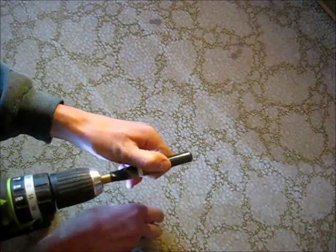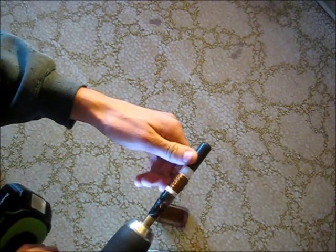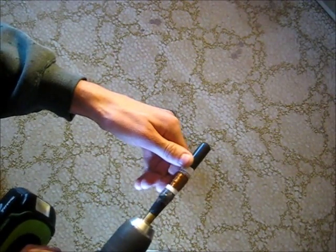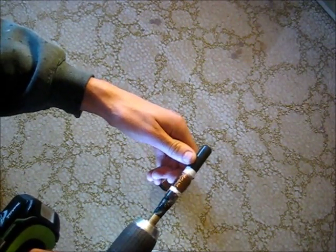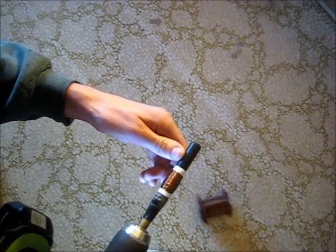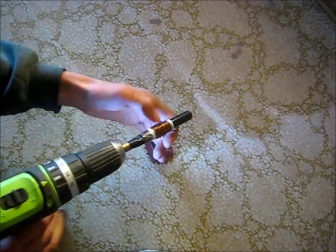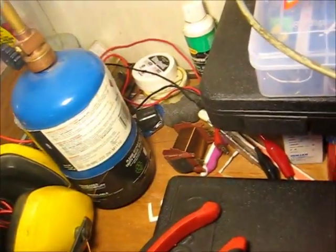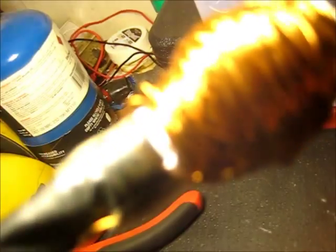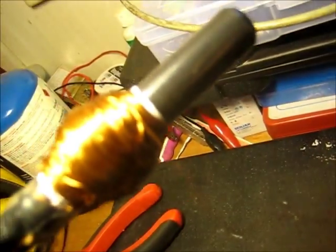Wind mostly in the middle. Now if I could do it properly I could get use out of the whole 240 volt winding — that'd be handy, though it may not fit. Still got a fair bit left on that magnet wire and that core. Messed up a tiny bit — didn't press it hard enough against each other and it just slightly unravelled. I hope it doesn't cause too much problems. Let's tape it up.